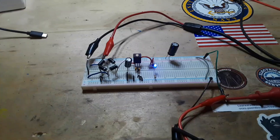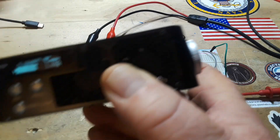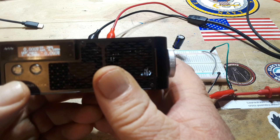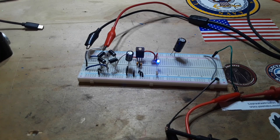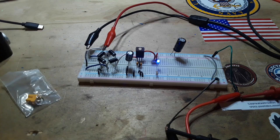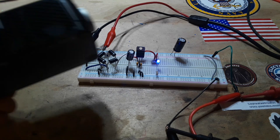Let me make sure this is doing what I'm expecting it to do. I just hooked up a voltmeter on the output — we're getting 7.37 volts out, so it's a little low. It's an 8-volt regulator, should be putting out 8 volts. What the heck is going on here? I wonder if this is what they're talking about with the XT30. I guess I'll have to put some wires on it and find out — of course it could just be something's bad here. But that is one of the things we use this for.